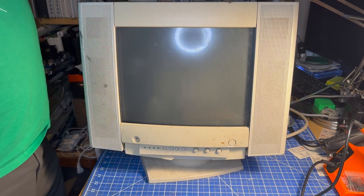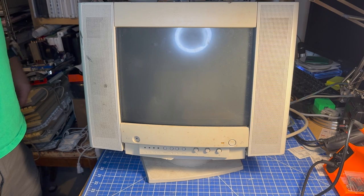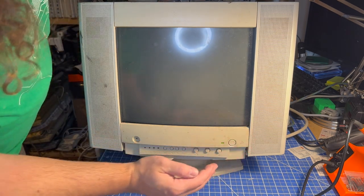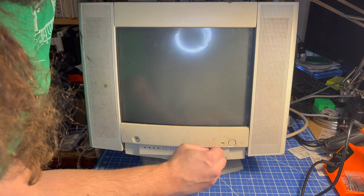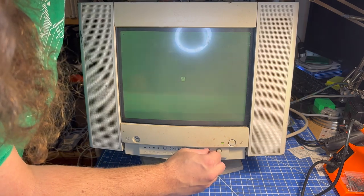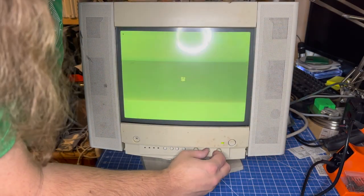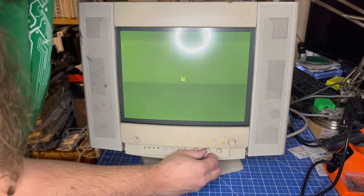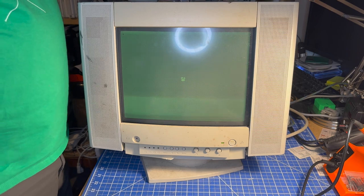In the previous video we know that it turns on, has high voltage, you can hear it running, and I have the orange light — it's green when you first turn it on but it goes to sleep mode. Let's turn on the computer and see if anything blows up. Good news: the speakers came through. We've got the green light and I just heard it fire up. Adjust the brightness — there we go. We have a working monitor! The CRT is all the way bright, but it's not super bright. Contrast and brightness are both all the way up — this monitor doesn't have a ton of use left, but it does work.